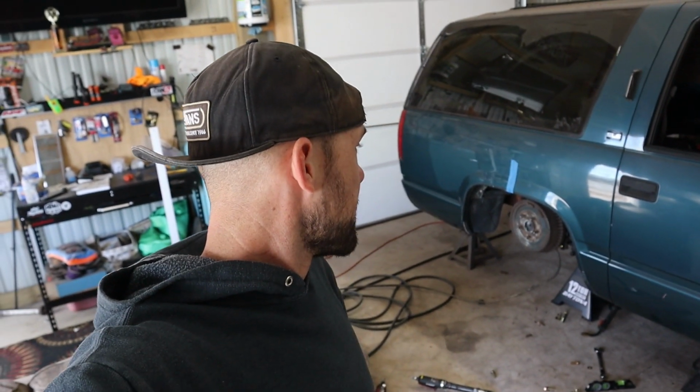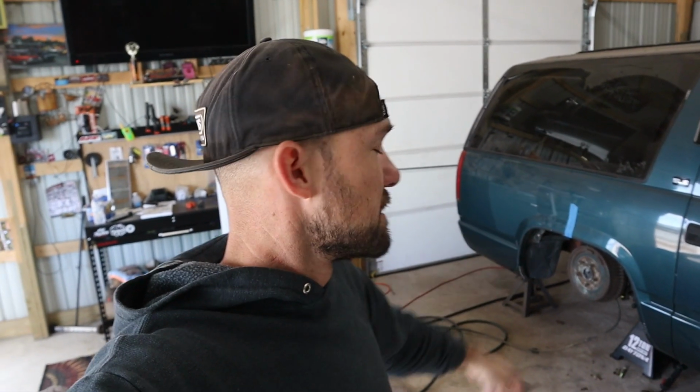What's up, guys? So it's another day. My brother's not here today. He did help me get the rear end locked into place so that way I can just swing the 4-link up and weld everything on. And once we get the 4-link tacked on both sides, then I'm gonna go through and do the Watts link in the back before I can blow everything apart and do a final weld. And I'll make sure everything moves correctly. And then we can start working on the bag mounts.